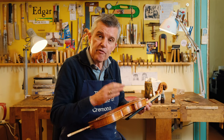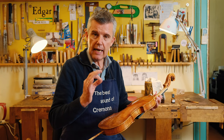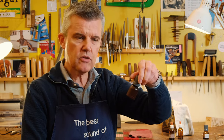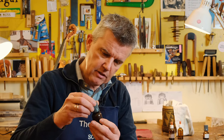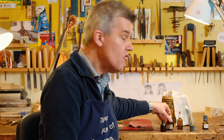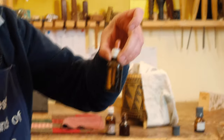Really nice results are obtained when you finish the surface as I finished here. Now this is everything but shiny — we sand it with a very fine micro mesh. Then I finish it with shellac dissolved in alcohol. I have a small bottle like this here with shellac inside. Then I have a small bottle of furniture oil, the very cheap one from the supermarket for two or three bucks. We use very, very little of this. And then here I have a bottle of alcohol — it's very liquid.